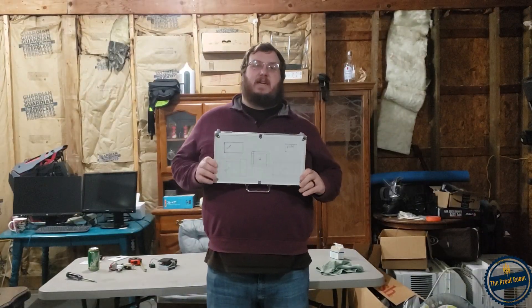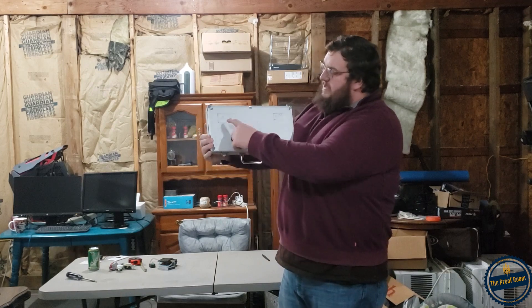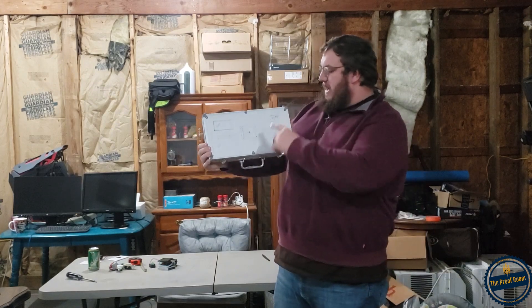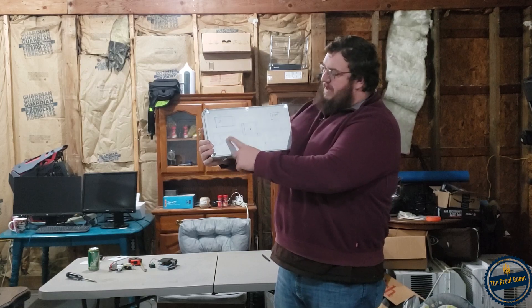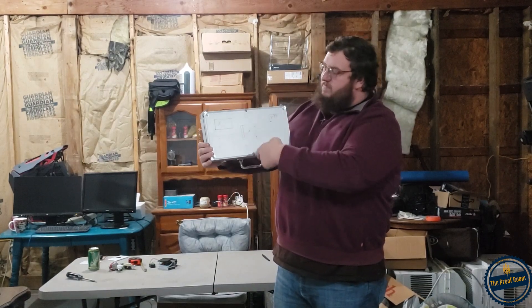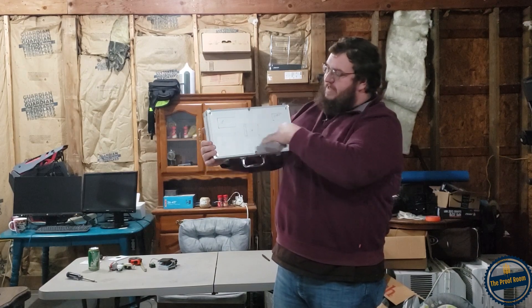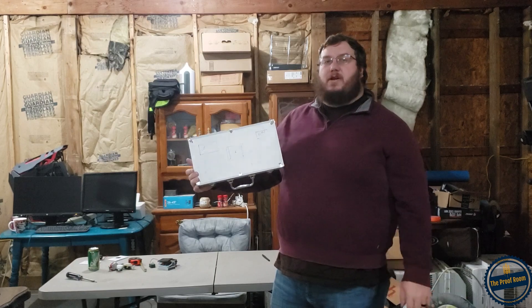I got this thing laid out the way that I want the box to look. In this corner I'm going to have my volt and amp meter, on this side I'll have my temp, one plug, my second plug over here, and then the control right in the center. I just measured this box, squared it up, and tried to line these up the best I could. I'm going to take this over to the Dremel, get this cut out, and then we'll come back.